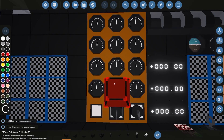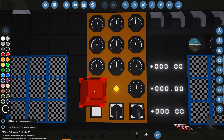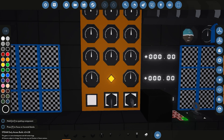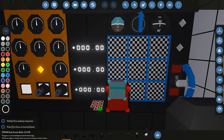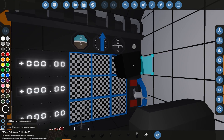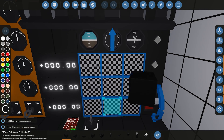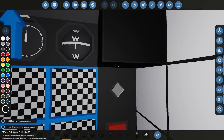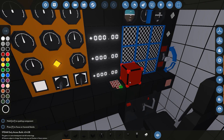We also have controls for our diesel engine: fuel tanks, rotation, temperature, battery level, starter motor, fuel pumps, exhaust pumps, and an indicator light I'll explain later. There are digital displays for altitude and desired altitude, a speed sensor connected to a digital display, the electrical circuit breakers we'll discuss shortly, another blank screen, a throttle to control our electric motor, and two more indicator lights we'll cover later.